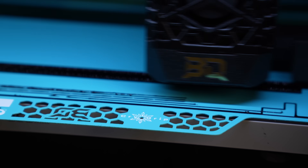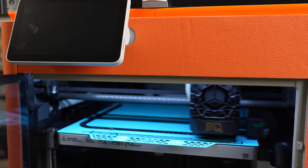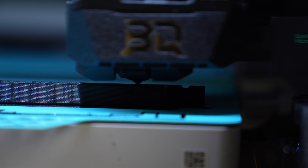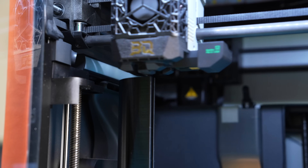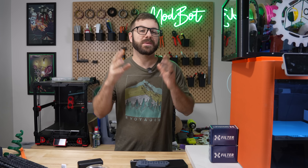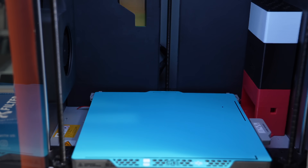Next, I switched over to the Glacier plate and installed it onto my X1 Carbon. I started out with a large PETG print that ran most of the length and width of the plate. While things started out well, partway through the print I noticed some slight lifting, so I killed the job. I then bumped the temps from 65 to 70°C, added a small brim, and it completed with no issues. I ran a similar version of that print a second time and it stuck down the whole time. I would say PETG adhesion seems good with Glacier, but not nearly as strong as with Frostbite.